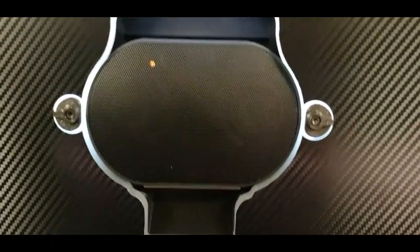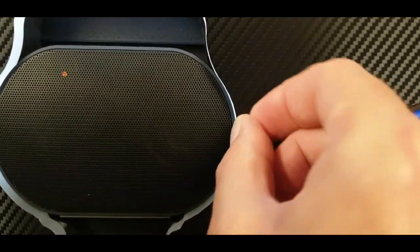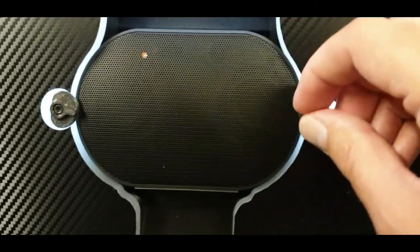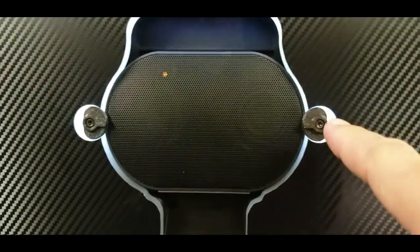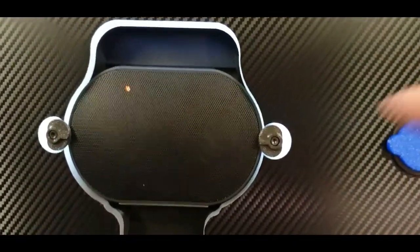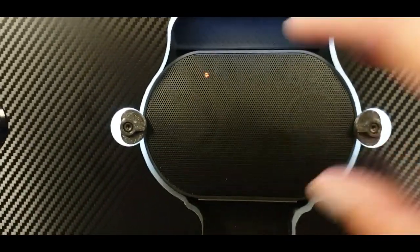So the idea is with these cams, now it's back in place, you can just rotate the cams. 1, 2. Obviously I like to make them as straight as possible. They might need a little bit of nibbing up as they get used, because they are going to wear, or smooth out the machined landing there, if you like. But so far so good.